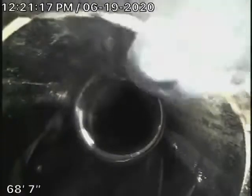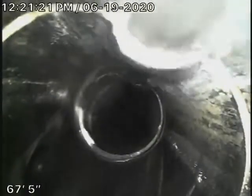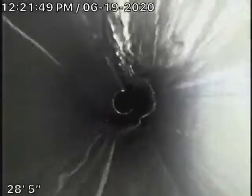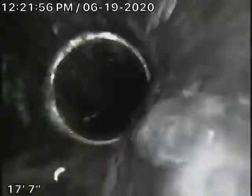Running the camera now from the little guest house — we're all the way out to the clean-out that we started off by. It's all ABS plastic and it all appears to be in good condition. We're going to flush the toilet back there to see the water flows pretty well. It all looks good. Here it comes out of the clean-out over there by the guest house.